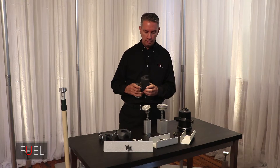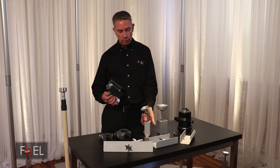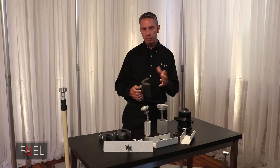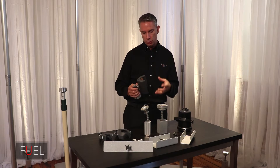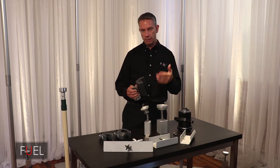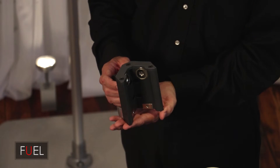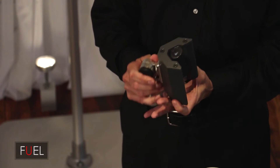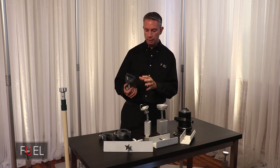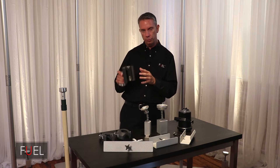Imagine for a minute that this magnet, as powerful as it is, is not meant to come off. When you connect the fixture to something, you clearly know it's connected — this is an incredibly powerful magnetic base. A lot of people said, well, how do I just get a single fixture up and remove it? If I'm going to make the magnet powerful enough, I've got to make sure it stays there, so I'm not going to make it easy to remove. Something else has to go up there and act as your hand. This is where the single install tool comes in. There are multiple magnetic ends to it — it pivots with this nifty little system where you press it in and it moves. It basically allows you to install a single fixture and then flip the tool upside down and remove that fixture one at a time.